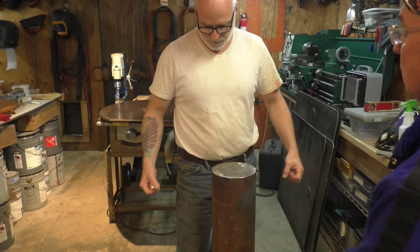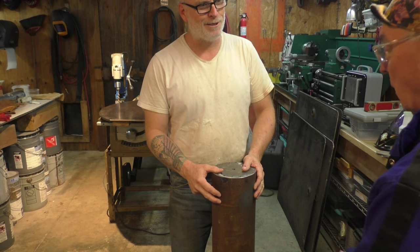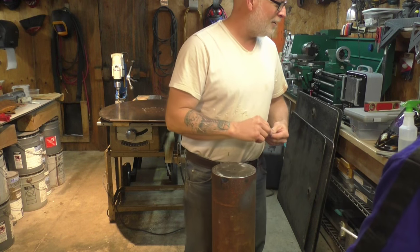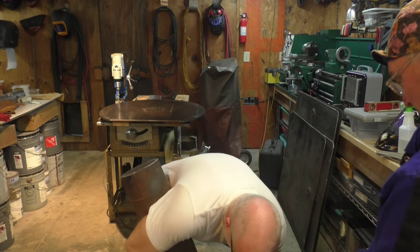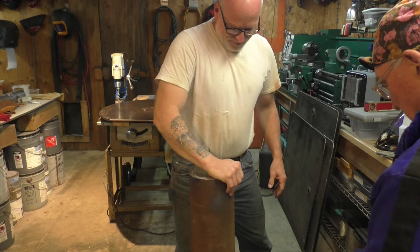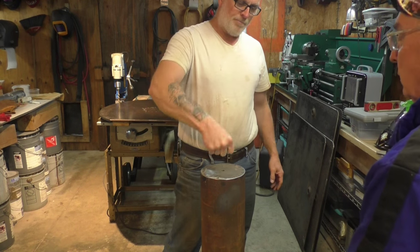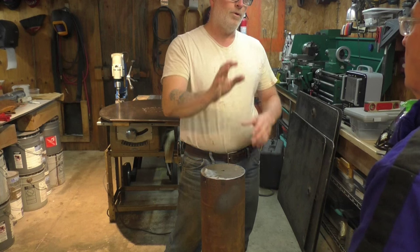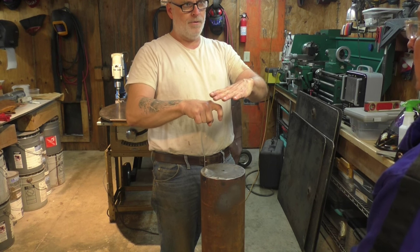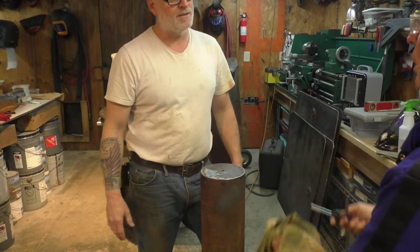The quadrant needs to be attached to the rudder post soundly. This rudder post is three-quarter inch wall pipe — this thing weighs 150 pounds probably. I can't shake it. Show the folks how tough it is. We need a chain fall or an eye above the rudder post. We'd tap this out and put a good bolt in it, then put a little pulley up here in the ceiling of the deck so we can lift this in and out. Once you get it up, move the rudder into position, set it back down, bolt it down — and then it stays.